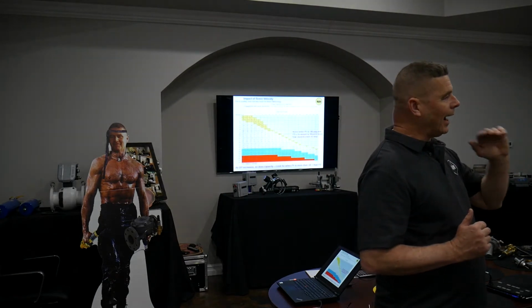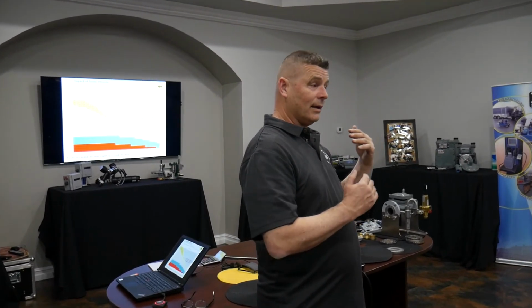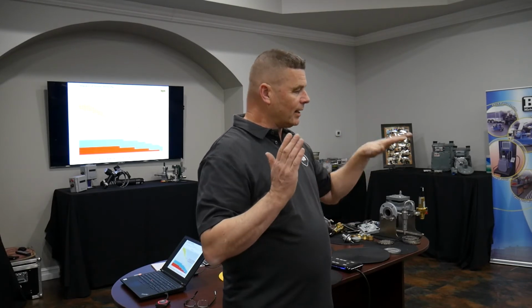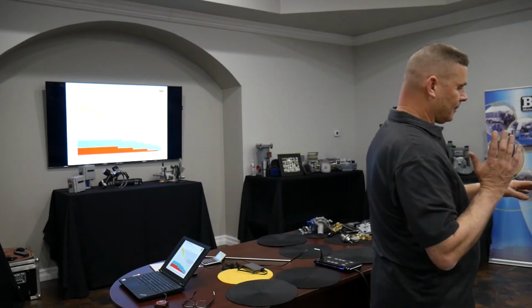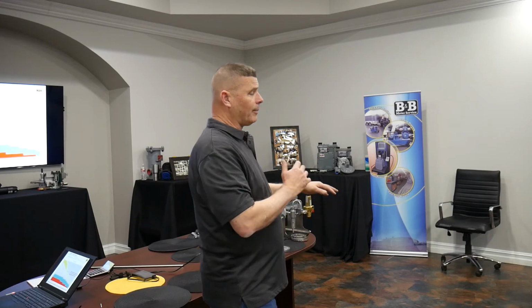If someone tells you, hey Cody, a regulator needs to be able to do 100,000 cubic feet an hour, okay? The hour part is the first problem there. If it does 100,000 cubic feet an hour at its max, does that mean there are certain times when it's doing more than that rate for a minute? Sure, it's going to be possibly up and down. Within that hour there are times when the flow requirement is lower, and sometimes when it's higher. Sometimes the inlet pressure might dip and the capacity might go up.